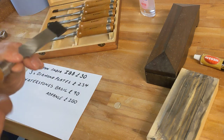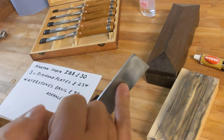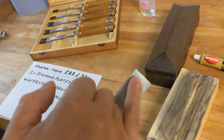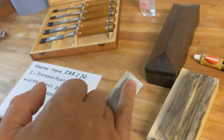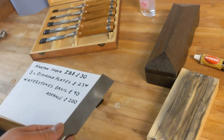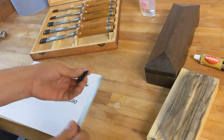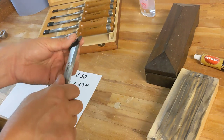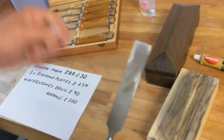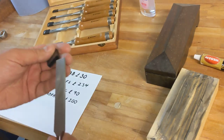with these. Now, if I show you the backs of these, you can see there are more machine marks on them. But with the sharpening method I put in, you can see that around the edge there, we've got the same effect as we've got there. So that honed level is the same at the apex of that sharpened bevel. That's absolutely fine, and that wasn't just that one. That was on another one I tried. You can see it's referencing nicely, no problem at all.